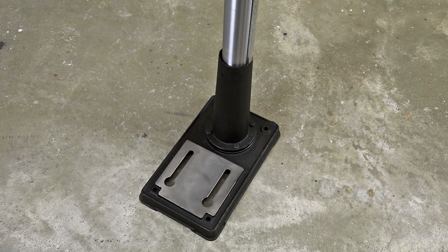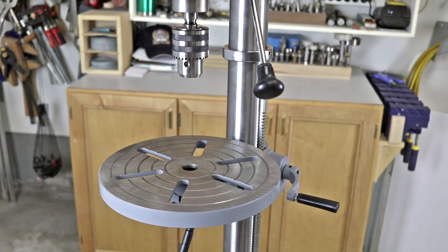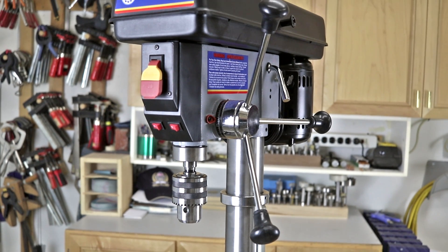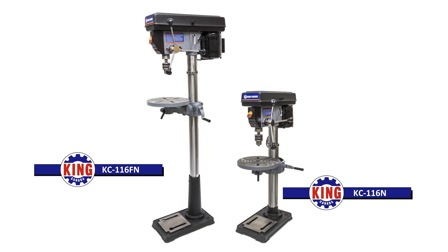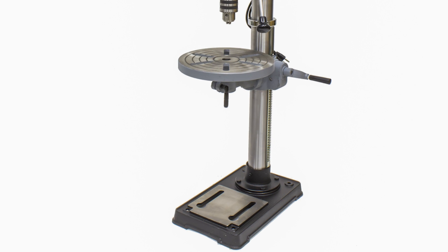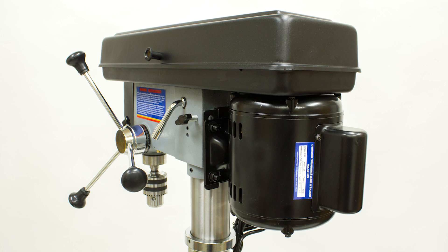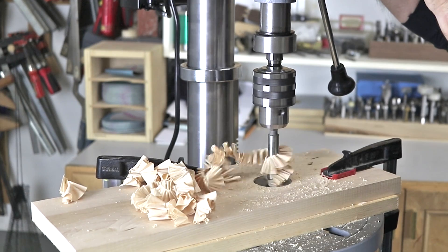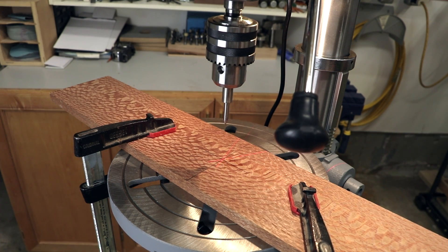The King Canada 13-inch KC116N and the KC116FN have identical features with one exception. The KC116N is the benchtop version of the KC116FN, perfectly suited for when floor space is at a premium. These drill presses feature heavy-duty precision ground cast iron tables and bases. A powerful 7.5 amp 110-volt motor provides plenty of torque for drilling a variety of materials. The dual intersecting adjustable laser guides feature precision drilling, and the halogen light with the included halogen bulb illuminates the work area for safe and accurate drilling.